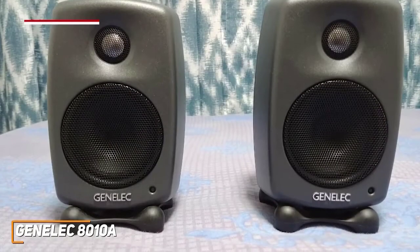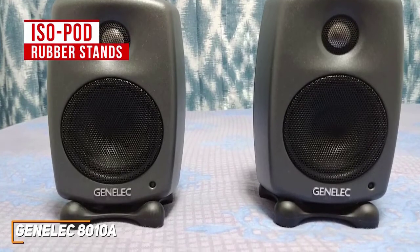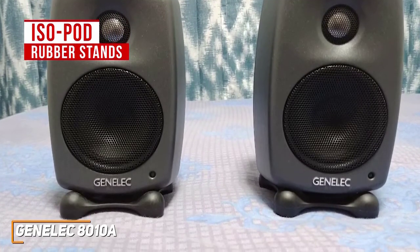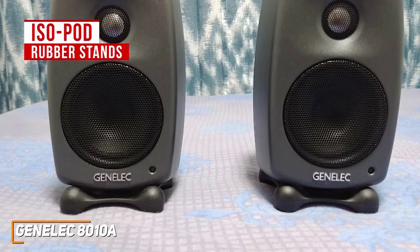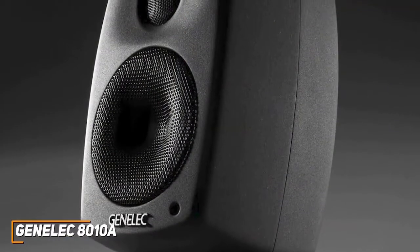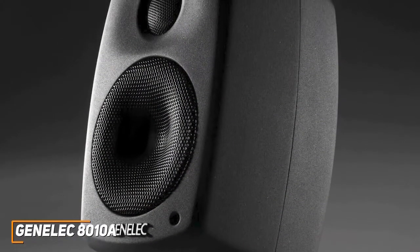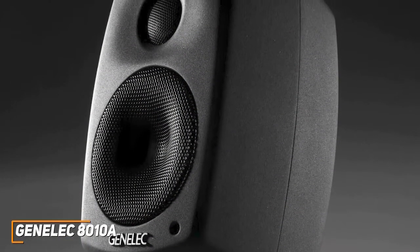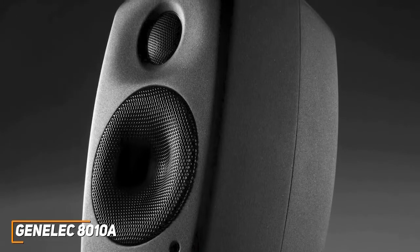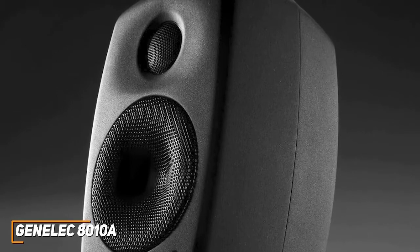It comes with tiltable isopod rubber stands, which allow you to adjust the axis angle and reduce vibrations while in use, along with mounting sockets for greater placement flexibility, but it only offers one XLR analog input. The enclosures are rear-ported and feature 5 dip switches underneath, including 3 to shape the bass response, a sensitivity switch to dial in the external volume control range, and an intelligent signal-sensing switch to disable the auto-standby mode when no